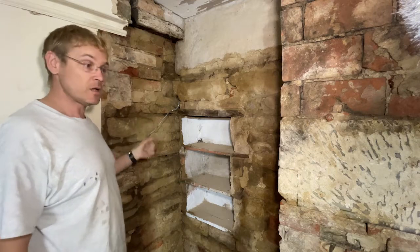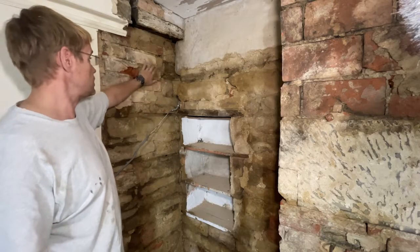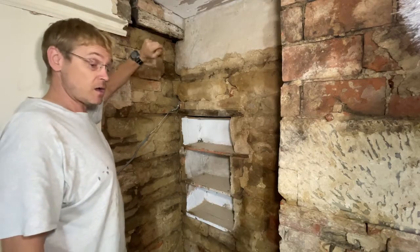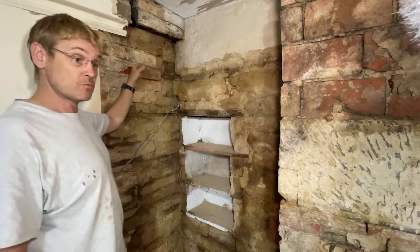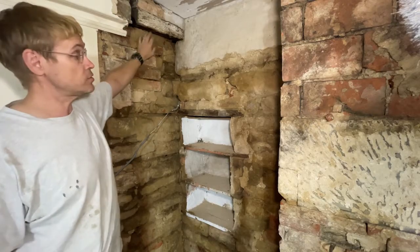The first stage in lime plastering is what's called dubbing out. And there we're filling any large holes, any big irregularities. We're not looking for smooth, we're just looking to build up some thickness. Our next layer after that, our scratch coat, will be a thicker coat again. But if we try to fill it all in one go, it'll be too much. I mean, that's that deep, so we'll bring it out in 2 steps.